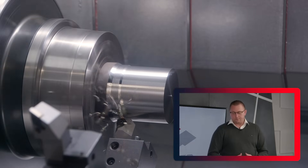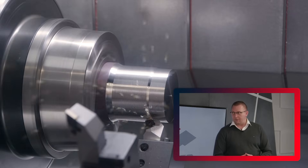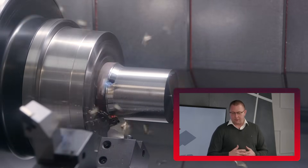With our medium geometry, we are taking quite a large depth of cut at a reasonable feed. But what we find is that with the lighter machines, they can't hit those parameters — you've got to slow everything down, use a smaller depth of cut. So it doesn't make sense to have a chip breaker that is 3 to 4 to 5mm up the cutting edge.